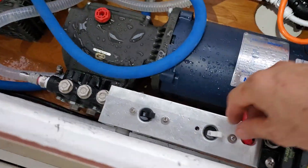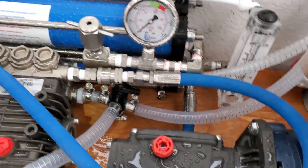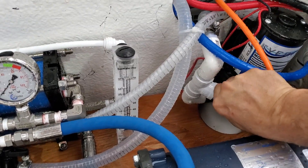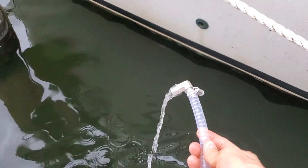And then we're going to turn on the boost pump and we're going to look for positive pressure. If not, we need to prime it by closing the little needle valve all the way closed. I can see the water is flowing and it is coming overboard.